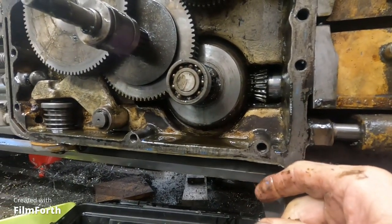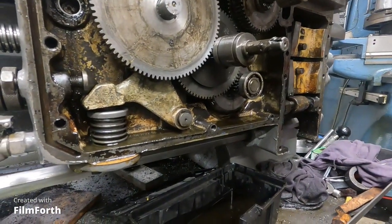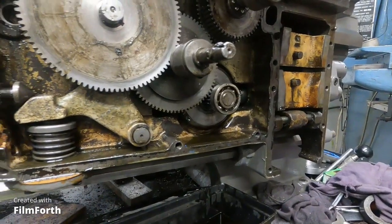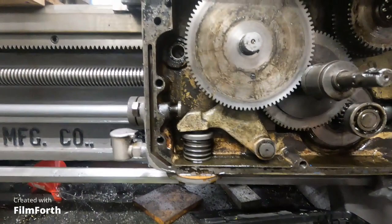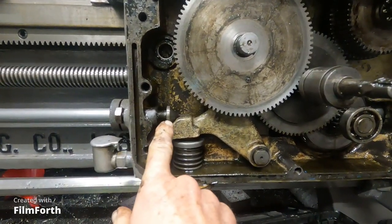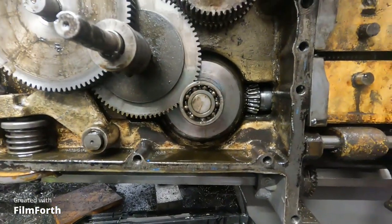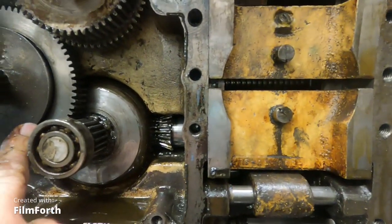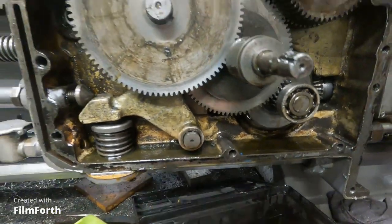Well, we'll see. It's a little bit different. I was hoping I didn't have to take the top of the carriage loose, but it sure looks like I'm going to have to do that. That shouldn't be too hard - they make this machine quite easy to work on, very surprisingly. Here's how that oil pump limiter works - it just controls how much this arm returns, I think. The longitudinal clutch is here. I don't see any metal in the bottom or anything. I'll just have to investigate further.